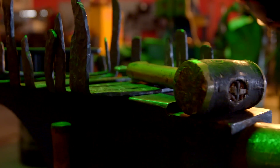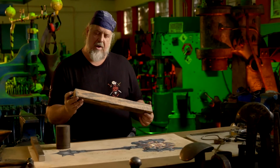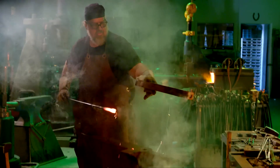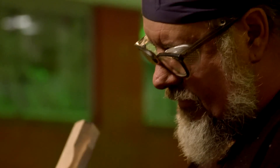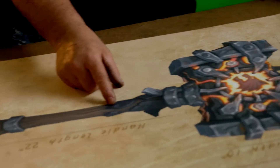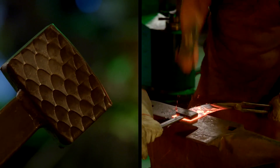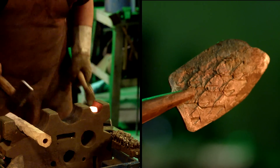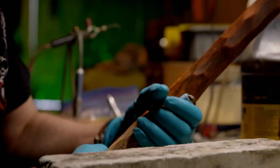After I forge the spikes, I'll screw them into the ball — that will complete the construction of the pommel. For the handle, the Doom Hammer will be made out of a solid chunk of oak. I'll drill a hole through the end and put a piece of 5/8-inch all-thread through the middle, because if it were just plain wood it would snap immediately. The ends never meet exactly in the middle, so I'm going to heat up a poker in the forge and push it through. After drilling and burning the hole, I take it to the belt grinder and give it a rough-hewn appearance — the look of a handle made with a knife or axe. There's a design element that shows patchy pieces of metal; I have a tool that imparts dragon scales, forming the metal to wrap around the side of the handle and burning it into place. I bring it to the layout table and stain it to give it the appearance of an aged old oak handle.